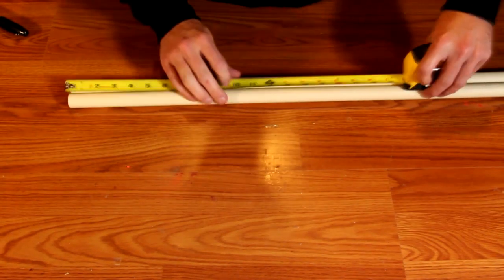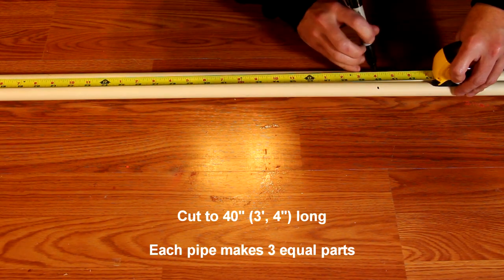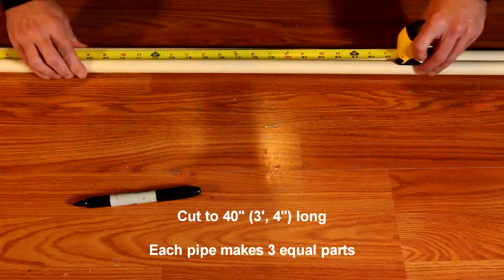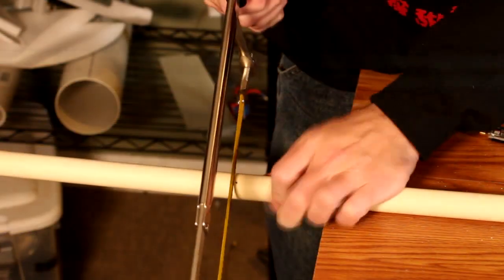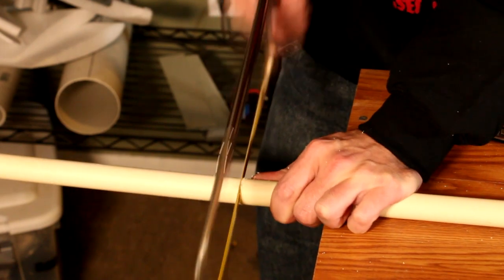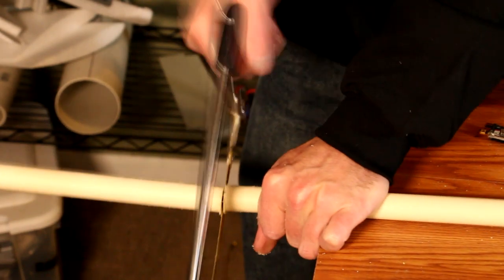To start this wing gate we'll need to make a few cuts. We're going to cut our two 10 foot long pieces of CPVC pipe down to six sections of three feet four inches long. This will make six equal length parts. If you happen to have a chop saw handy that's a lot easier, but any old hacksaw or back saw can cut through PVC pipe with relative ease. Just brace against the table and hope you get a reasonably straight cut.